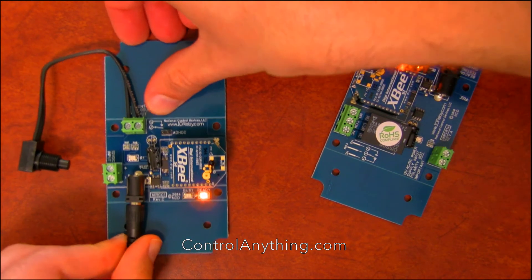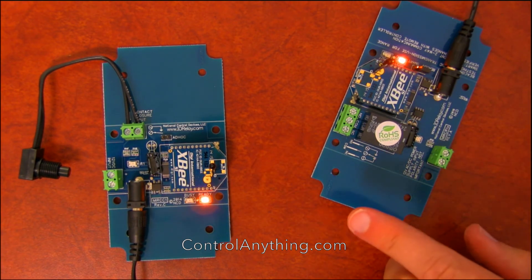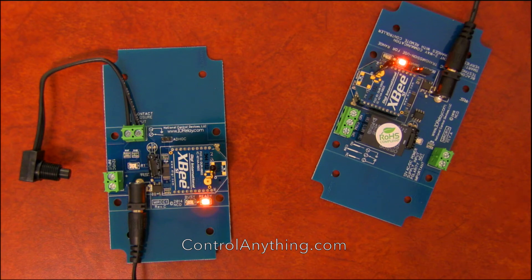This particular controller has a 300-foot range — it's a very short range device. It's not made to go through walls very well, and it really needs to be a line-of-sight application. We do have a two-mile range version that really does work over a distance of two miles — we've tested it. That two-mile range version is a much better choice if you need to go through walls.